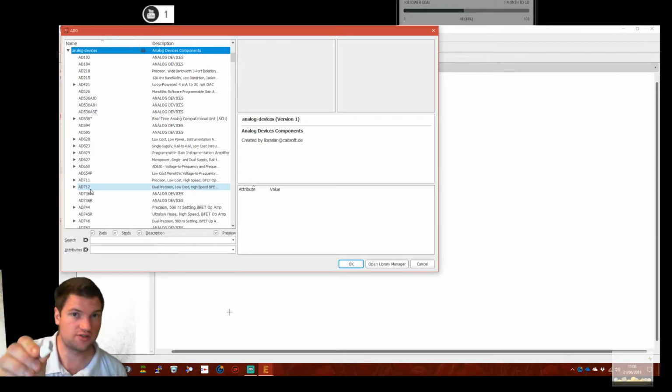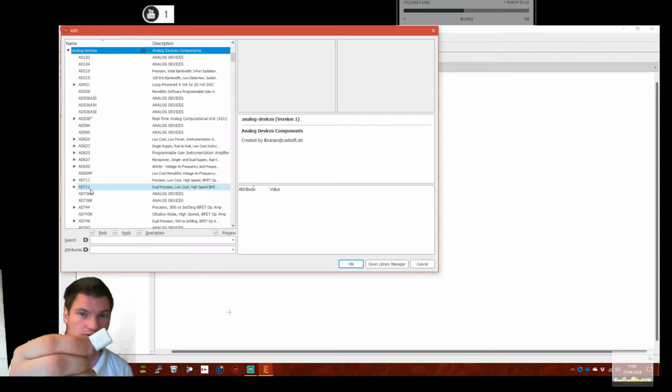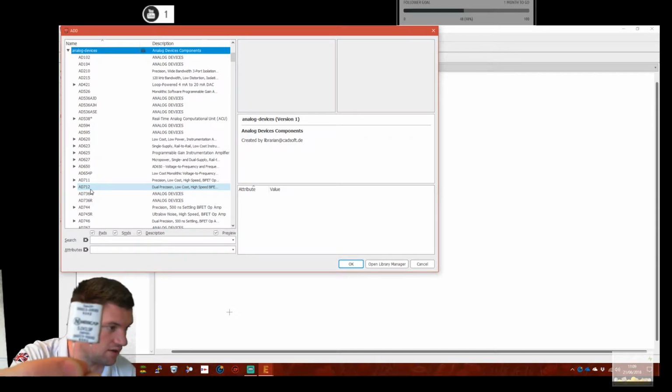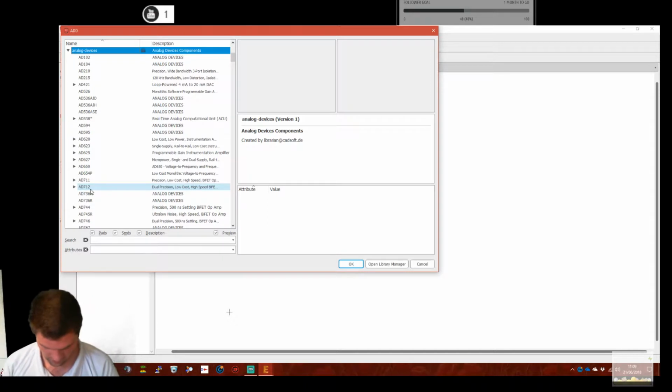This is actually 2 supercaps in there. You can see the 2 of them. Will it focus? Maybe. So there's 2 just bundled up into one package with the dual leads on. And as you can see here, that's 2.5 farads at 5 volts. Won't focus, you blasted thing. Whatever, take my word for it. It's 2.5 farads, 5 volts, and that's for a dual cap, non-balance. So these could technically run away from each other.